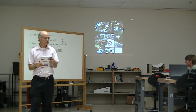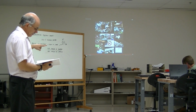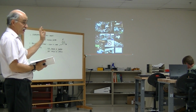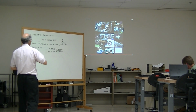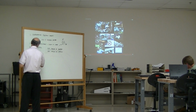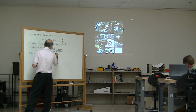So you've got to figure out what my driver speed has to be and what mine is. We want to know how fast the driver shaft is rotating, right? And then you figure out what your goal is. Okay, I want the fan to rotate this much, and that gives you a drive ratio, right? After you know your drive ratio, the next thing you do is pick your sheave diameters. And this will be from a chart, no math here.